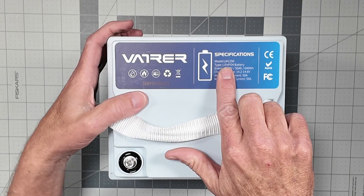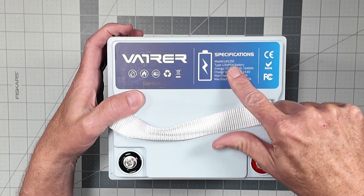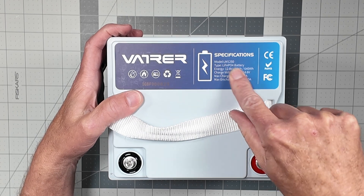This thing feels like it's ready to go. This battery claims to have a low temperature cutoff sensor inside — we'll see if that's something we can test without tearing it apart. The model for this battery is LM1250, Lima Mic 1250. It's a 50 amp hour battery, so a 50 amp current draw at full capacity — a 1C rating — would give you one hour max.